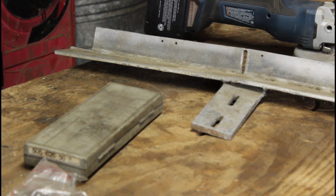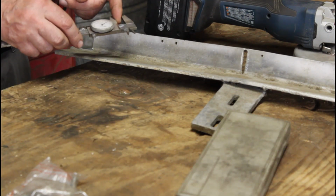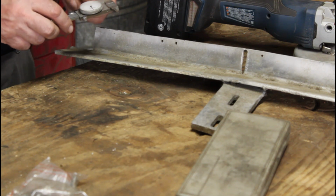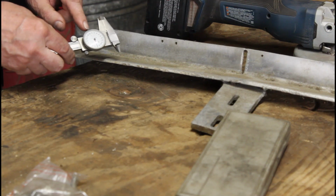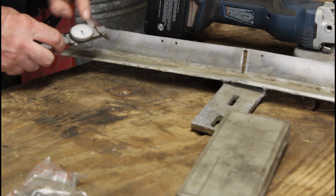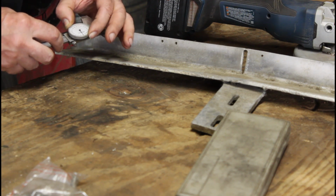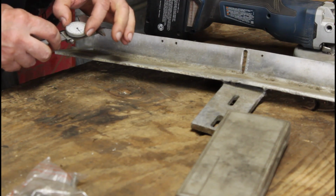when you're making something that small, you're going to need some calipers. These jaws right here, you're going to have to clean them off. And then take this, close it completely. Okay, and then there's a screw down here, and you have to take that loose. Then you turn the face, this dial, until you get 0. And then tighten it down.